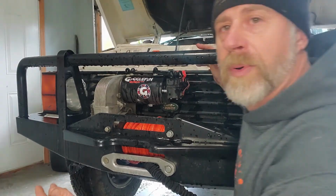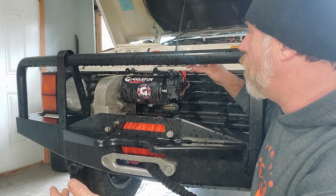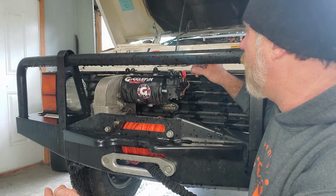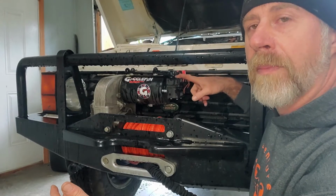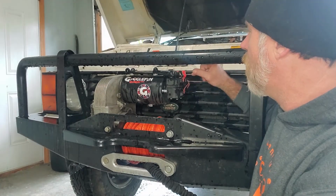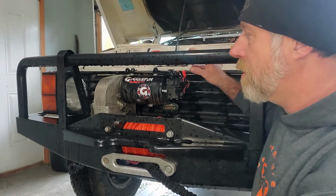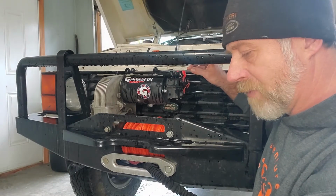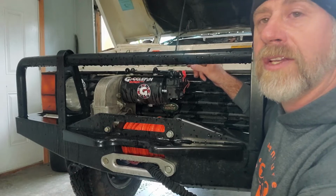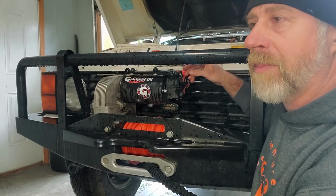now you just need a jumper wire. So we know the motor works, it tested good, and we're not hearing any clicks from the solenoid. Real quick, to make sure it's not the remote, take a jumper wire from your battery. It can be any size, any gauge, 16, 18 gauge, whatever. You could still use your jumper cables. Put one on the positive.